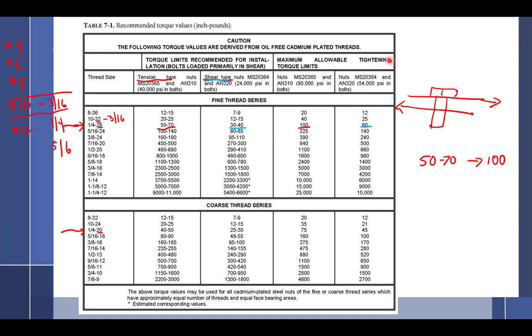And what if the chart isn't in the engine book? It is. Trust me on that. It has to be, and it is. I've never run into a situation where it wasn't. They don't make Haynes manuals for airplanes? No. So you get a whole separate engine manual. It's very different than airframe. Airframe and engines, when it comes to torquing bolts, are different in the sense that airframe is almost always dry. Engines are almost always wet with a 100 weight oil.